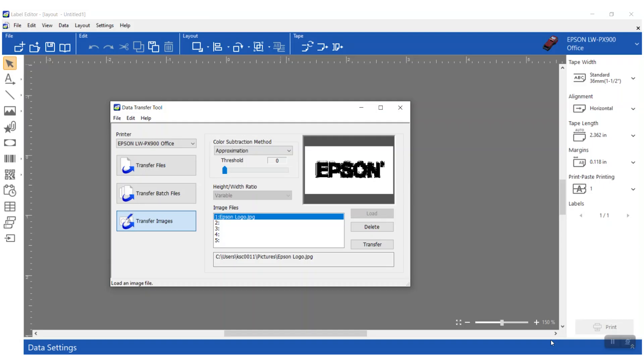A tip: I've already tested ahead of time the exact settings I want to get my image just right so it prints exactly how I want it. You have some options here to do that, and they will carry over into the standalone unit as well. I used the approximation setting and then changed the threshold slider — which is kind of a black and white slider — setting it to 245. That was the sweet spot I found.